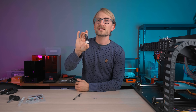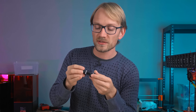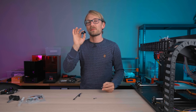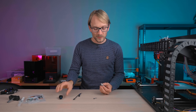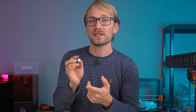So this is what you typically think about when you think hotend. Well here's the thing — the largest part of the hotend, the heatsink, is actually one of the least important parts. You need it for function, sure, but it doesn't need to be precisely manufactured or made to super specific specs. So to me, the actual Copperhead is this: the heatbreak, the heaterblock, and the nozzle. Here's how these parts are all special in their own ways.